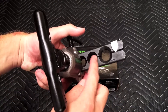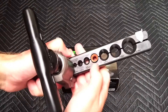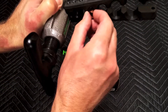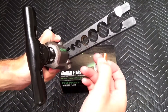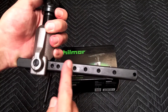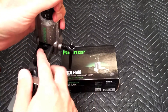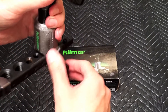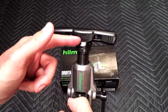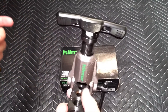It has a closed pin design, so opening up the flaring block section is a lot easier. Slide this yoke down - it has this piece of copper flare here from the factory so the yoke doesn't get damaged during shipment. On the side there are detents, so you can slide the yoke down into place and know it's positioned correctly. Then you'd have your copper inside, set the set screw, get it snug, and continue the flaring process by screwing this down. One of the things that makes this unique is the auto-clutch - you just screw it down, and once it clicks, you know you're done, so you're not going to over-flare.